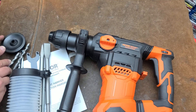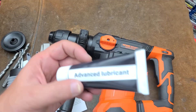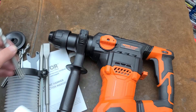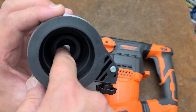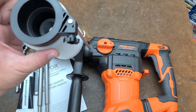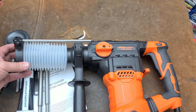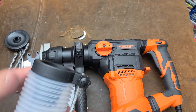Just for general use, if you're tearing up tile and stuff, what it can do is help provide a little more protection for the actual chuck adapter itself and help it last a little bit longer. Don't forget to grease the shanks — that's why they come with this grease. This grease tube is not for putting in the gearbox, although you could. It's for putting on the shanks so that the splines don't wear out when you're running. The larger dust catch has a deeper cup and a rubber seal, covering the end of the tool a little bit better.